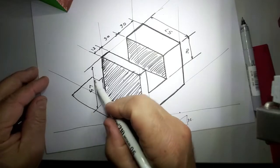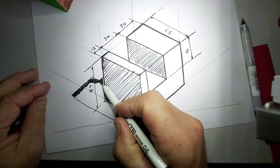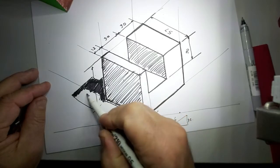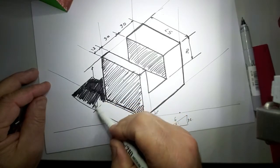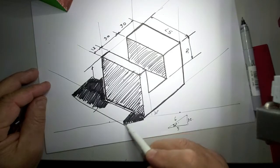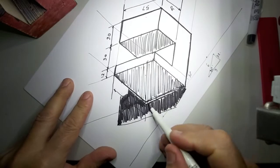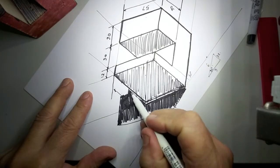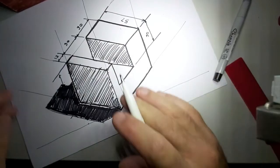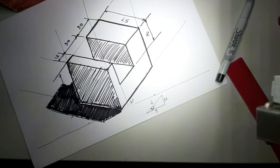If you're a designer and want this to really pop out of the page, thicken the outer edge and produce a shadow. With the light coming down this way, the shadow will come out here like this. You can blacken this outline and leave a little bit of white space just around it. Of course this departs from a strict isometric drawing — isometric drawings won't have shadows — and it becomes more of a pictorial 3D representation, making the object look more three-dimensional and lifelike.